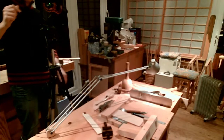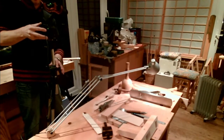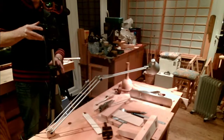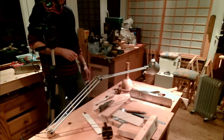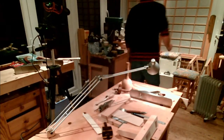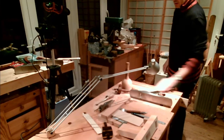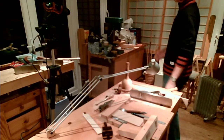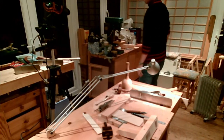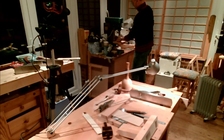Oh, sorry. Yeah, someone was asking whether I've ever sprayed water into the jaws of a chuck to help with work holding. That's not something that I've done. It's interesting to hear it. If I'm holding something in the vise which I don't want to really crank down on for fear of squashing it, but it won't hold properly, then I'll often use some leather. So face the jaw cheeks with leather.